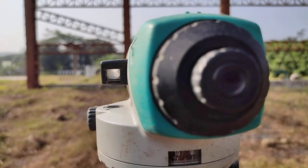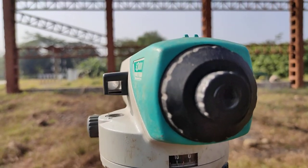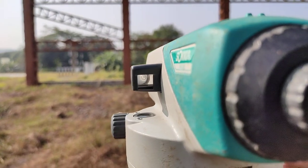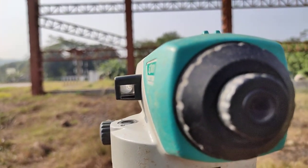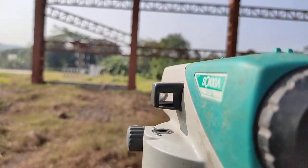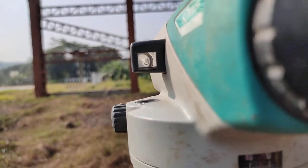You can see it clearly - it's tilting towards this screw, which means the level is high at this side. That's why it's tilting. So we have to lower this side. We have to lower this screw height. This is the first step you should follow.